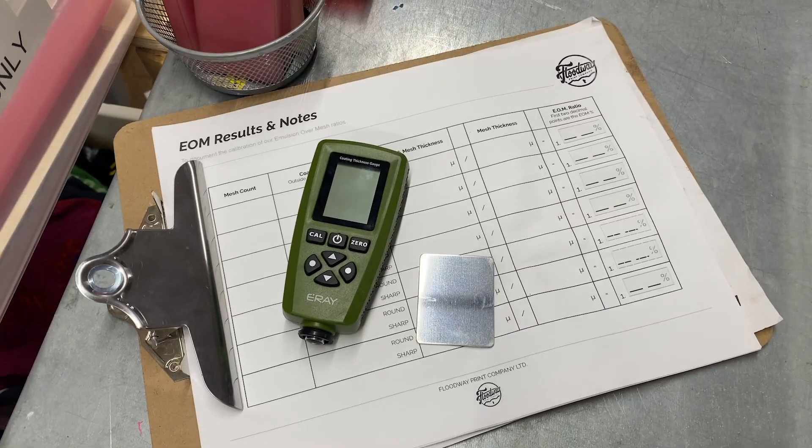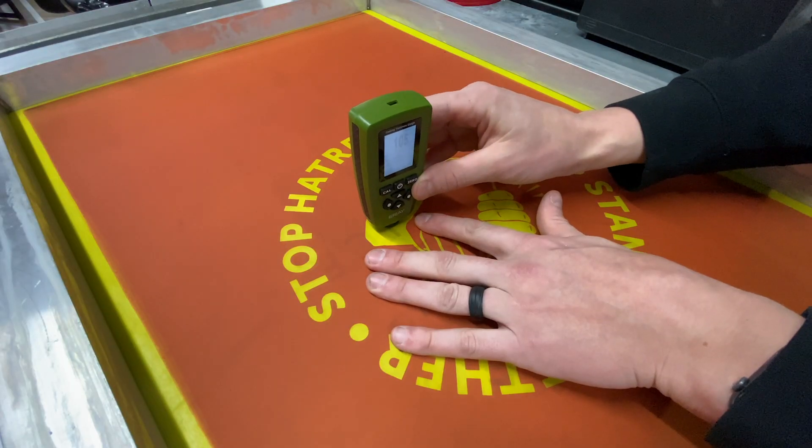I checked our emulsion thickness for consistency, which tells me that our coating method is being followed properly. Any difference in coating angle, speed, or even the amount of emulsion in the scoop coater is going to give us inconsistent results when testing exposure. Feeling good about those variables just pushes us further down the path. Our hunch is that the screen had been exposed to too much UV between being coated and when it was exposed, but we couldn't really tell how long it was in the rack. Being on top of the rack near the lights made us wonder about UV even more.